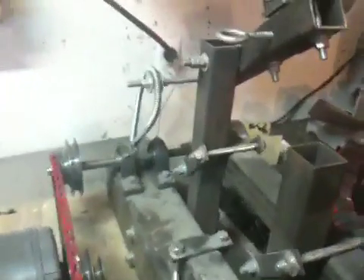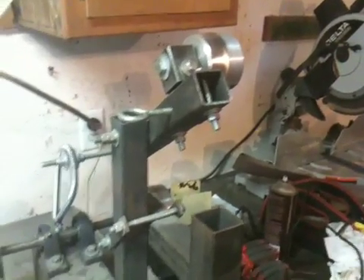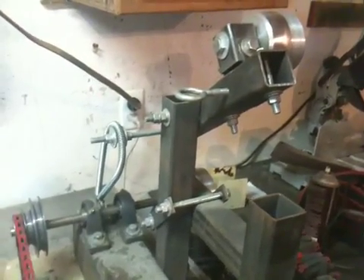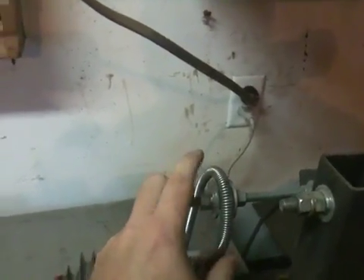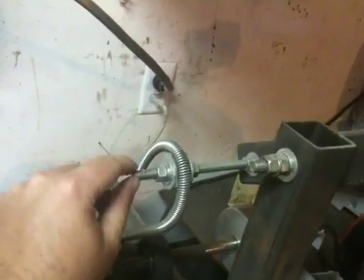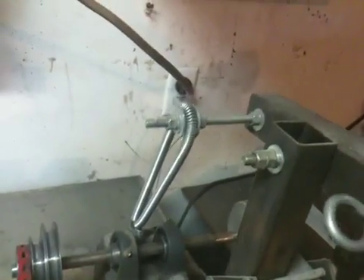So I took a look at it. I talked with a guy on blade forums — we were discussing the small wheel attachment, and this is kind of when my problems started manifesting. He gave me some advice on checking my spring tension and just making sure that everything was stretched tight enough to keep it on the wheels. After looking at it for a little bit, I noticed that this 3/8" threaded rod seems like it's bent down just a little bit from where it was when I first built this. There's a lot of leverage on this once the spring is under tension, and so I think this bent down a little bit, releasing some of the tension from the spring that's normally on this wheel.